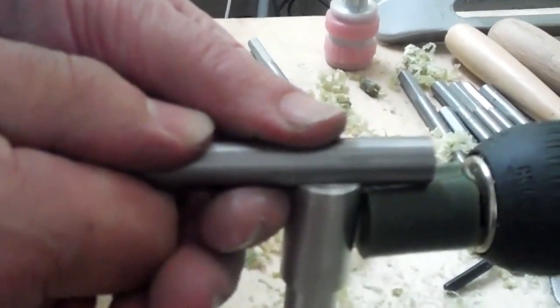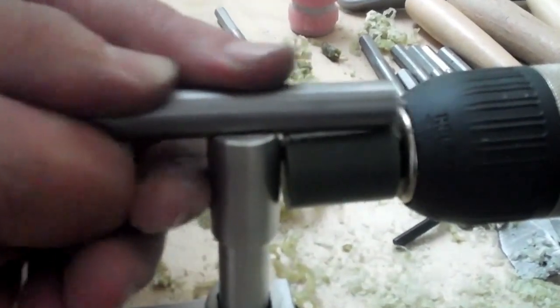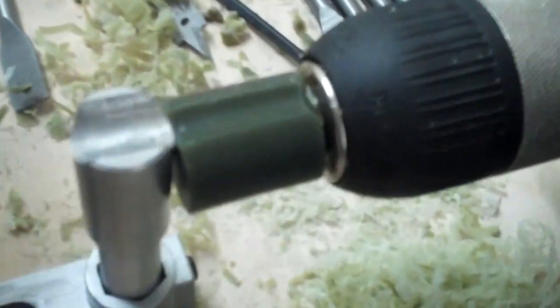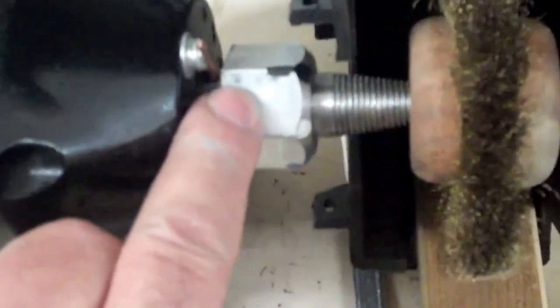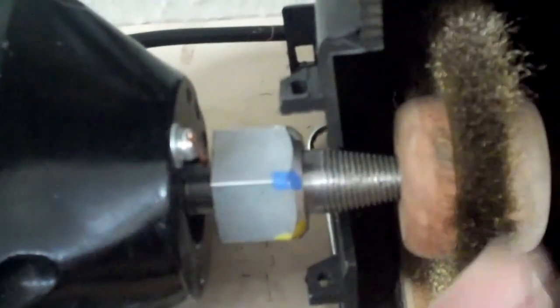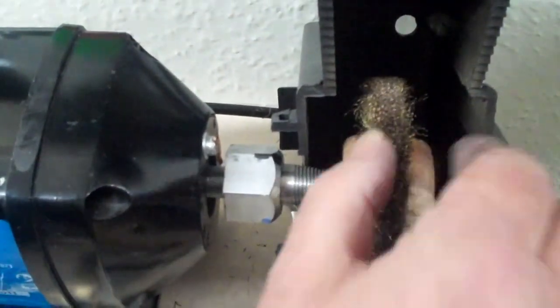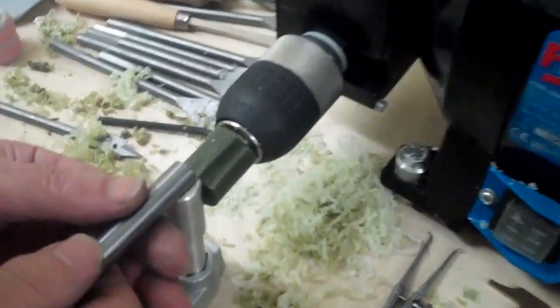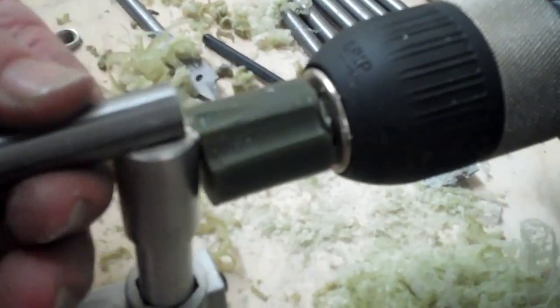So I'm going to use this chisel gouge to make a flute. These are quite deep — you don't have to go in as deep as this. It's quite a nice finish, and when I've gone down as deep as I've set the guide, there's a hexagonal collar I put on here. We go from the one marked black, one whole turn, which moves the output one twenty-second of a turn. Two turns gives us one eleventh of a turn, so we'll have an eleven-grooved flute — quite coarse, but a guide for putting stones into rings made by parting sections of this fluted length off.